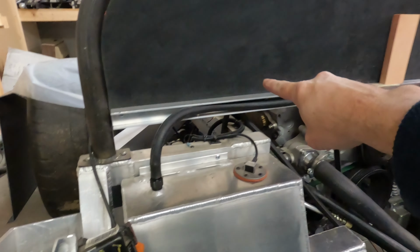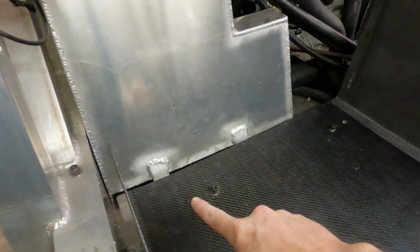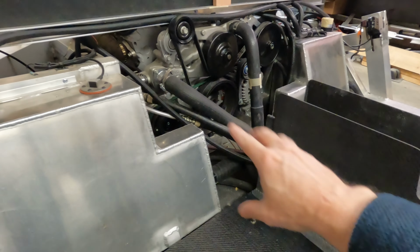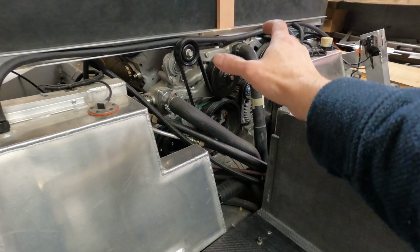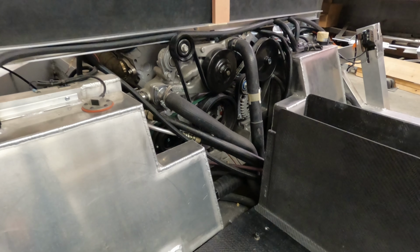I'm going to have the same machine screws that I used to bolt across the top here into this aluminum piece, I'll have done here across the bottom also, so they'll match. And then by doing that, I'm thinking these two separate sides back here for this rear firewall and this center console cover that comes up into the speaker area may all be glued together as one assembly.